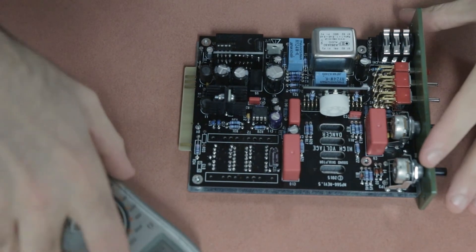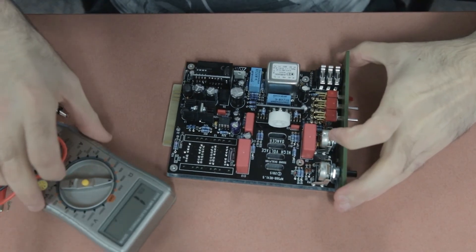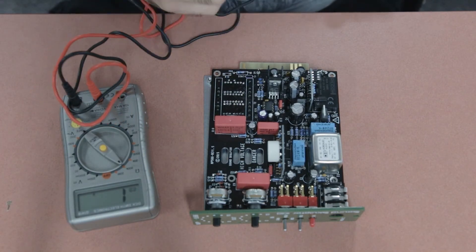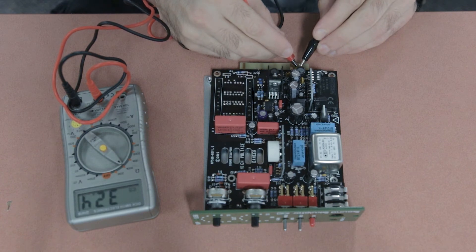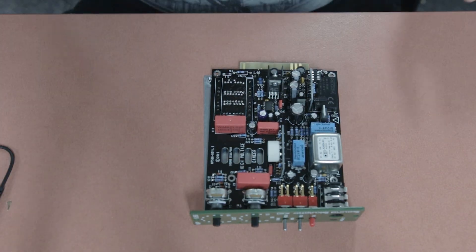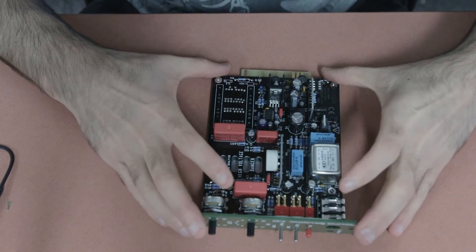Get your multimeter and the MP566 test guide. Step one says to do a basic short circuit check with your digital multimeter set to ohms. You want to test between test points ground and V-plus — you should get several kilohms — then do the same between ground and V-minus. This confirms there are no shorts before you start applying power to the board.